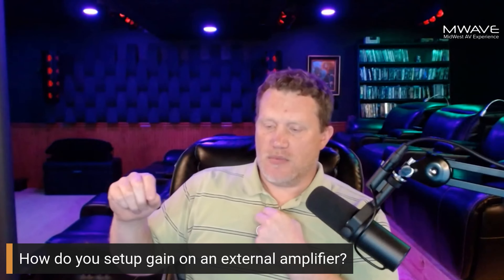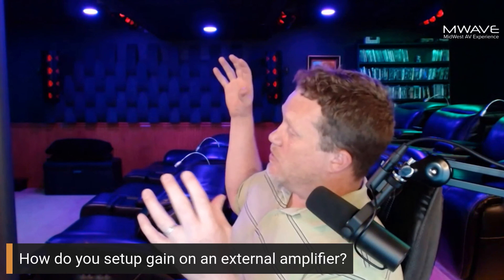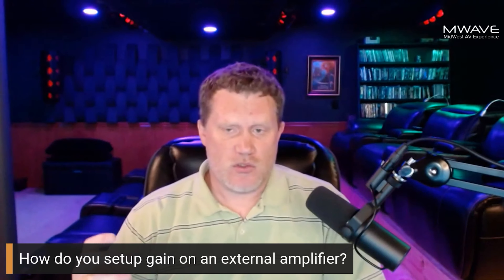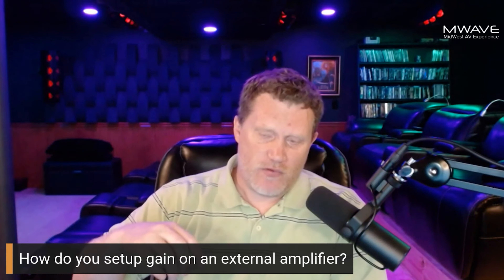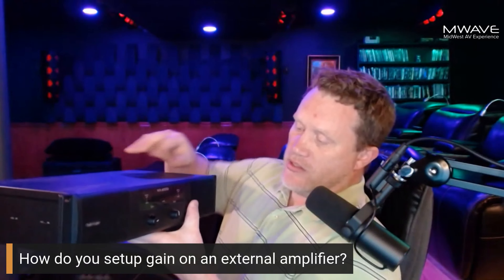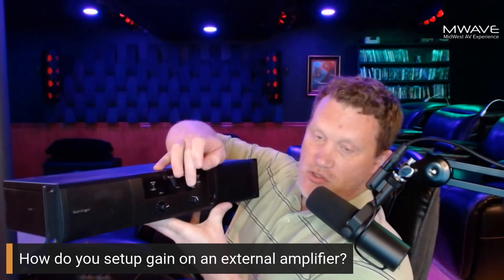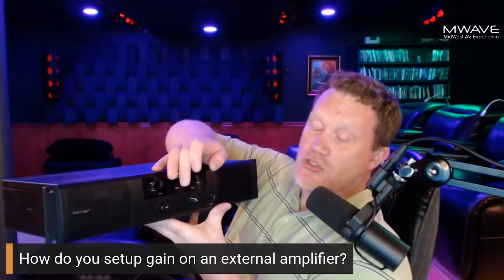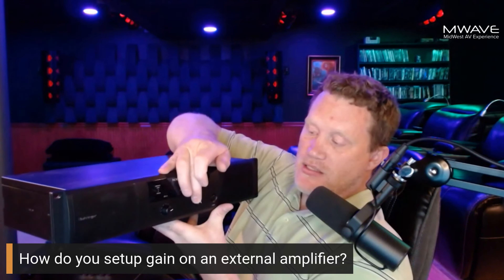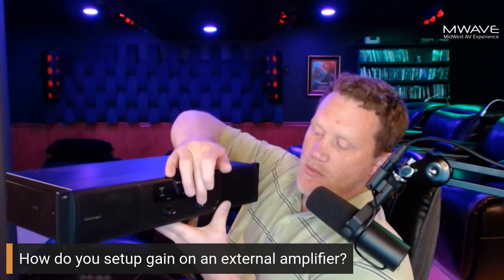If it's input clipping — say I have 15 speakers and 7 dB is being redirected — I need to lower my subwoofer trim, perhaps from negative 9 to negative 11, and I might raise my input attenuator knob. On these amps with attenuator knobs, each click indent is traditionally 2 dB. So if I raise the channel trim by 1 dB and raise the attenuator by one click (2 dB), I'm getting 3 dB combined — that's the range of gain structure you can work with.